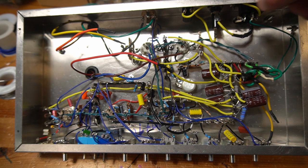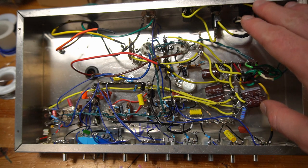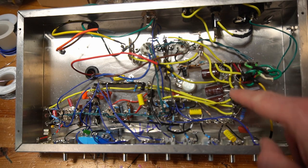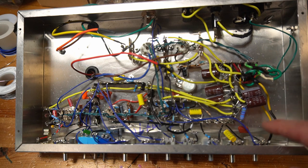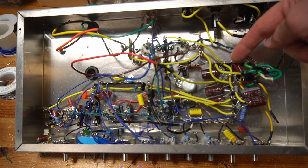So we put a fuse in. We put an IEC cable in, and we just take it one step at a time. I've gone through startup procedures in the past on my channel on what I like to do for that, but I'll go through them again here just briefly. Basically, you just want to follow the power supply. Really, these power nodes are the most critical, right? So you put a power cord in. Are you getting 120 volts AC here on your primary side? Then you'll see, is that powering right here? I've got these two red wires coming out on the secondary for my high voltage. Am I getting the proper high voltage?